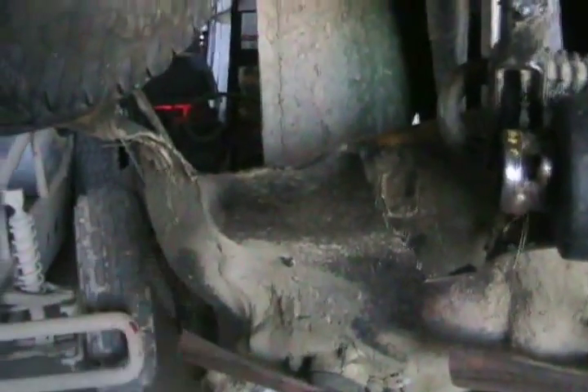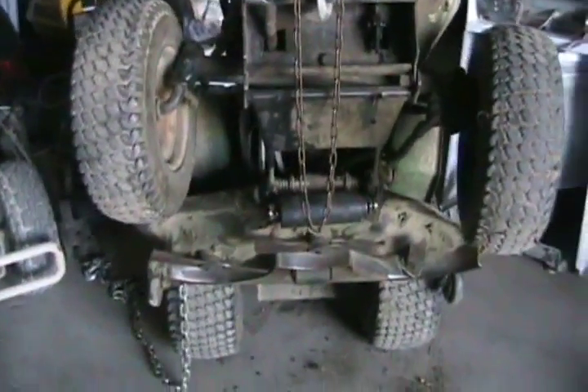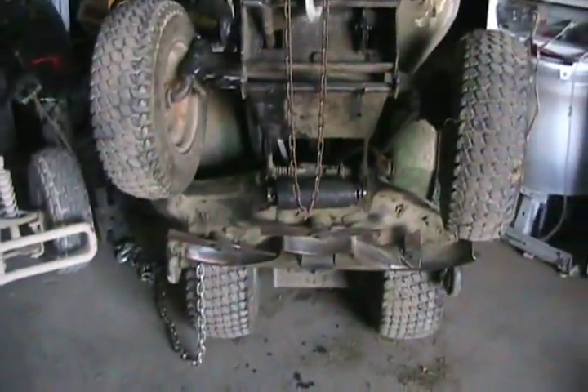One thing I did to modify my tractor, because I often cut very deep, long grass with it — it doesn't work very well with a standard deck, it just bends the grass over and rubs on it, and you drive over and it stands back up again. So what I did was take the cutting torch and cut out the front of my deck. Since I don't use this thing in the city, I use it only at the farm — that's perfect for me. The only disadvantage is a lot of grass flies all over the place, so sometimes you get some in your face. It also likes to suck it into the air intakes on the pull starter and clog them up, so while I'm driving I'm just brushing those off occasionally. But it made a huge difference to how well it cuts long grass.